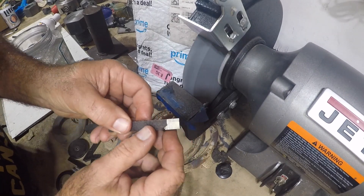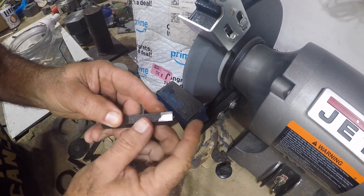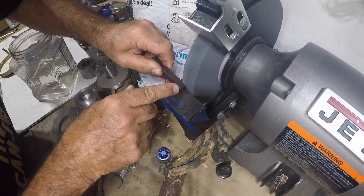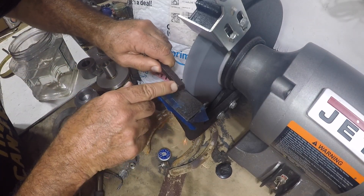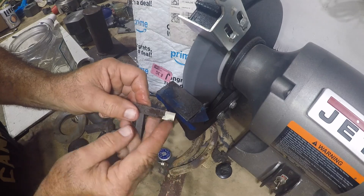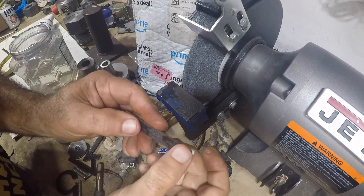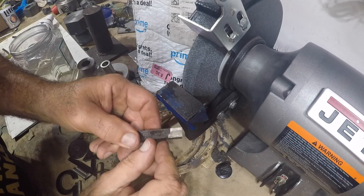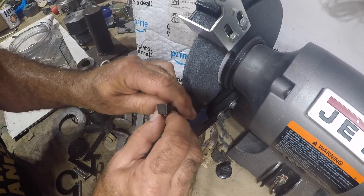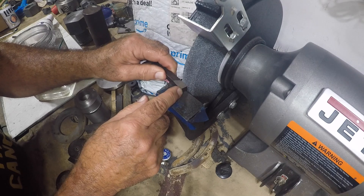This is the cutting edge, so I'm going to work on that. Now I need to come back more on the bottom. This is actually going to be the cutting edge — see, that's my relief. This is the relief here and this is the face. Now let's put a big radius on that thing. I'll try to get more of a face angle here.